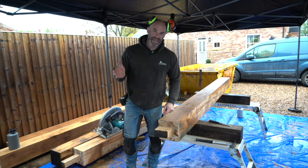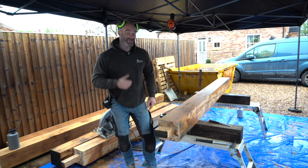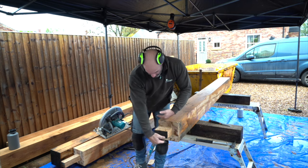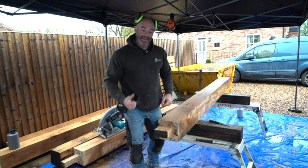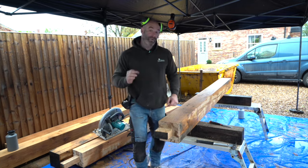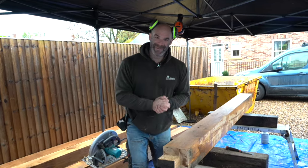So this post is one that's getting bolted to the house. It's got a tenon with three shoulders, that's to accommodate the wall plate. The wall plate is going to sit on top and we're coming off in that direction. It's a little bit awkward to explain as we are on the trestles here, all will come apparent. We've got one more of these to do, then we can look at some mortises and we get to play with the chain mortiser, which is always good news.